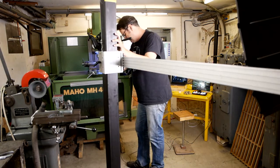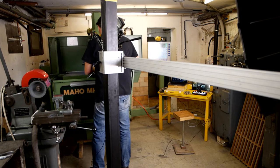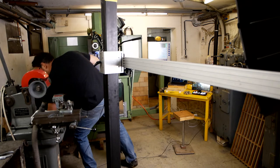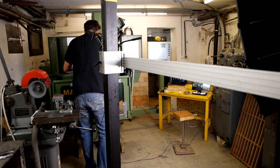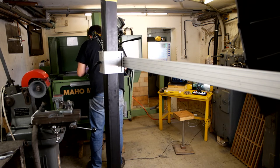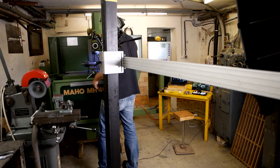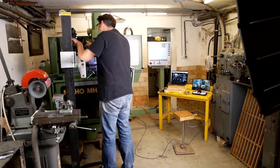Grab my tools. This is pretty funny, I guess. You set all this up, you practice it all afternoon, but that just doesn't work on race day, huh? Yeah, now that's definitely turned. It started cutting and then veered off. What I might do is also reduce the depth of cut and cut it in two passes. Here's the wide view again.